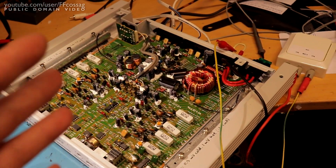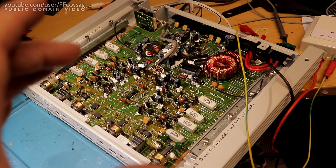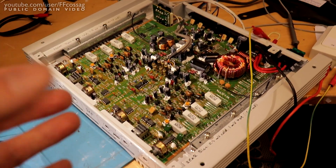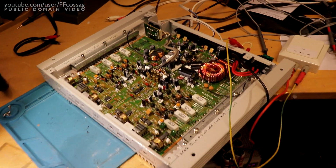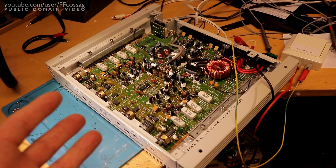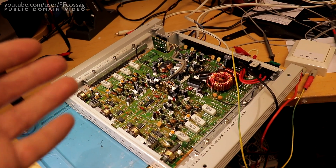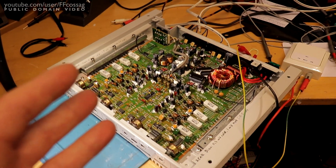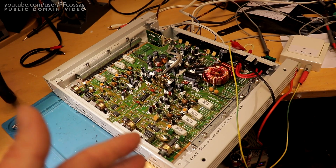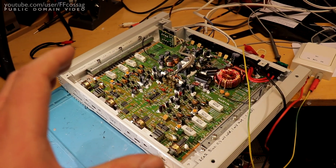But it had another very big weakness: the power supply. Because of how it's built, it's kind of cheap on the power supply side, and there's just a ton of crosstalk coming through between the channels on the power supply rails — a ridiculous amount. You can play music into two channels, turn it up to about 50% power, and very easily hear that music coming out of channels which have no input signal. In my application — driving two front car speakers and a subwoofer — I was measuring around minus 20 dB damping on the unused channels. Ridiculous crosstalk.